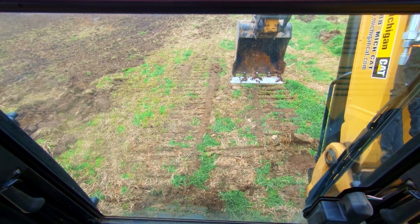Now we're sitting much more level than we were - that's one way you can level yourself out. I would recommend anytime possible, make yourself level along the entire track base, just because it's gonna make you a lot more stable for digging.